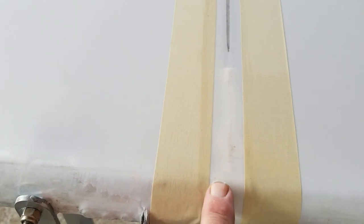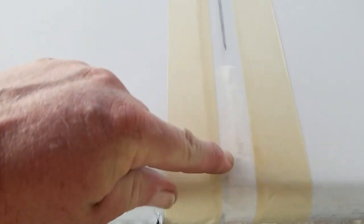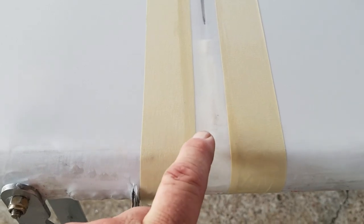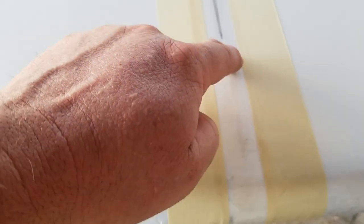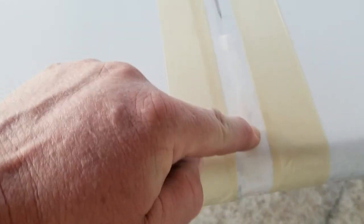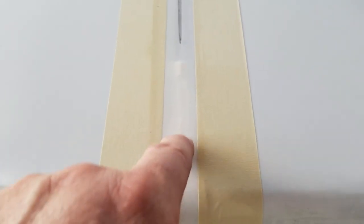and dry. Now back here, you'll notice it's a different color, and this is where I have applied my anti-chafing tape, and it basically goes around the back of the wing, because we do have some rivets along the side here, and there's a little bit of an edge, so we put two layers of anti-chafing tape. And so right here, this is tape, and we did saturate that to try to get some glue in there. I'm not sure how well that'll stick, but I think we have enough contact area here that we're going to be all right.